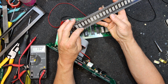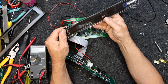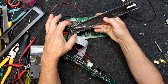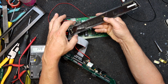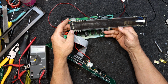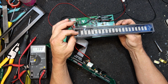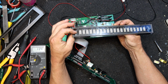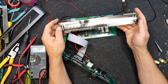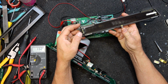dots here, isn't there? We have a 5 by 7. So is that 35 or so? How many pins we actually got though? 2, 4, 6, 8, 10, 12, 14, 16, 18. So that's about right. That's about 36 pins for 35 digits. Because we don't need any decimal points or anything with this, because they're all decimal points. So that would make sense, because we've got 2 filaments taken out of that. I don't think I included the filament count in that.